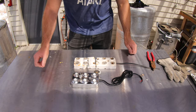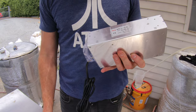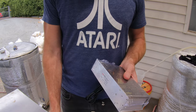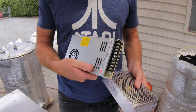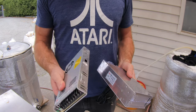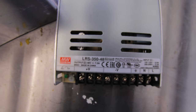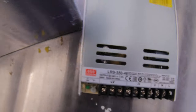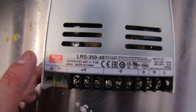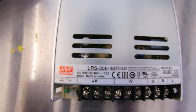My new one is a 6-disc, not the 10-disc — there are a few reasons I've gone to that which we'll cover shortly. This is the power supply the 6-head fog comes with — just a cheap supply, and I don't think these are that reliable. I prefer to use better quality power supplies, and I usually go for Meanwell. That's a Meanwell supply there — both are 48 volt, this one is 7.3 amp and the other is 4 amp, so the Meanwell has a lot more capacity. Some people say I can be rough on Chinese-made parts, but China does produce good quality stuff. The Meanwell is also made in China and I've never had an issue with any Meanwell drivers or power supplies.